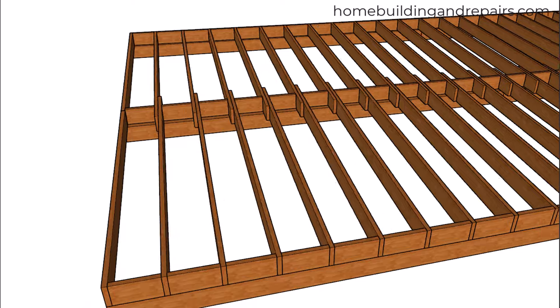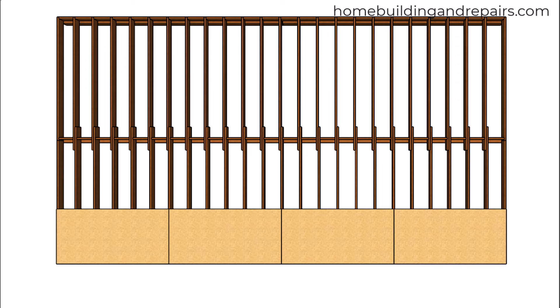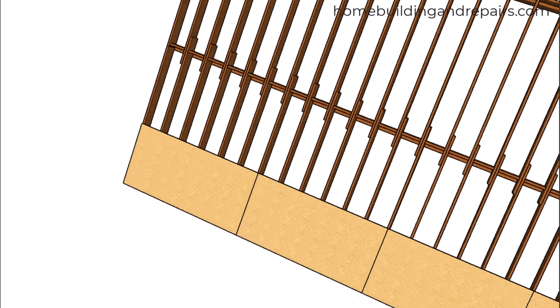But I don't like to do that. I like to get the nice connection you're going to get by nailing this lap together. And you will too by the time you're done watching this video and you see how easy it is to make the plywood sheathing work. So let's go ahead and install our first row of sheathing that is breaking half on the joist and centered on these joists.